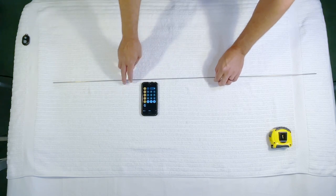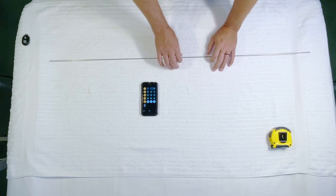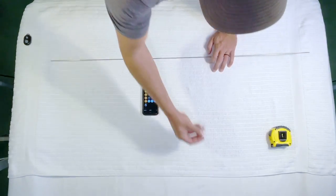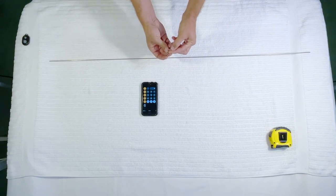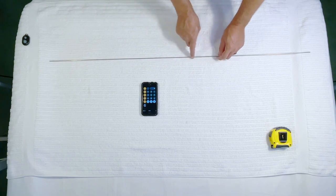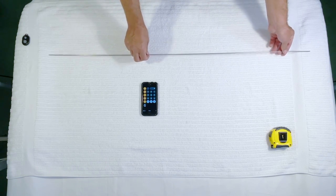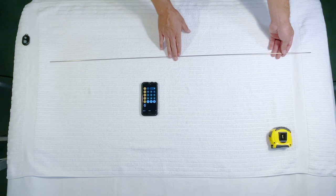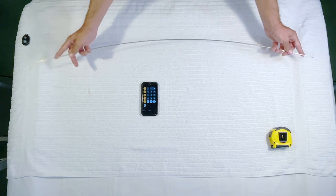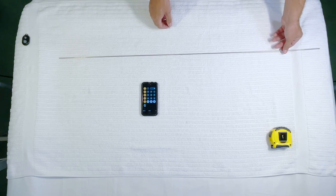We've got our stainless steel bar here. By the way, this is 1/8 stainless steel bar, and the inner diameter of these sleeve swivels is just over 1/8. So I think it's like 0.128, and this is 0.125. So that is the bar that I'm using for this rig, but you can use whatever you want. I wouldn't go too much thinner than this though. Otherwise this thing is gonna bend really hard and probably just be garbage. I'll spend all this work for nothing.